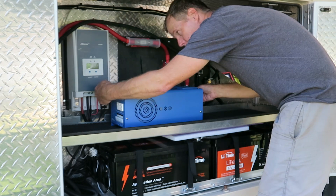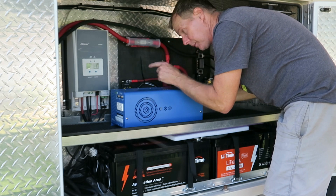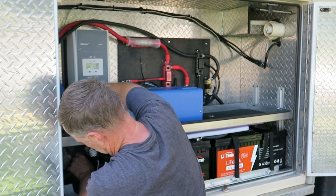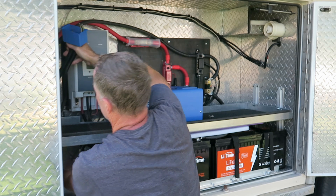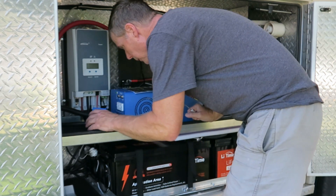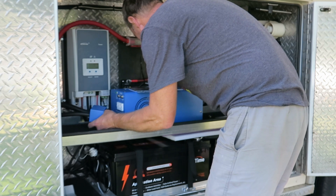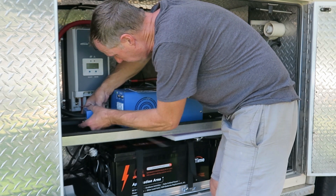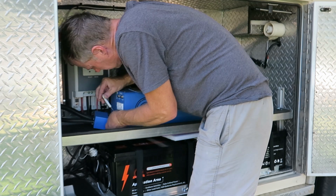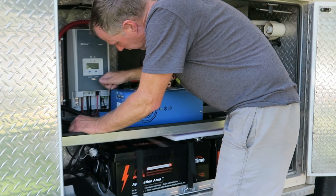I've got to get it all wired up while I still have access to that wire, but I can't plug that wire in until I turn everything on. You don't want to smoke your charge controller by having input with no output. I took a picture of my inverter wiring before I tore it apart. I did label these — it's green, black, white, just like they're still laid out. We've been that way for four-plus years. Green, black, white — white, black, green. Those are done.